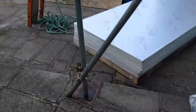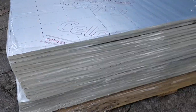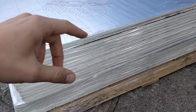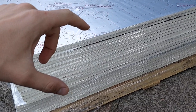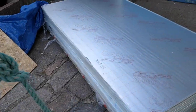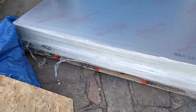It is another day for insulation. This 12mm insulation goes over the top of the rafters — so you have the tiles, the batten, the felt, the rafters, a little air gap of at least 20mm for condensation, then the 100mm insulation, then this 12mm, then plasterboard over the top. They're big sheets, eight foot by four foot (2.4 by 1.2 meters), and not particularly heavy.